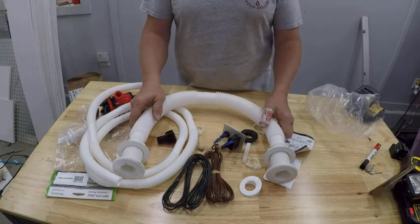These kits come with pretty much everything else you need: the wiring — it's already 10-gauge — clamps, and the three-quarter nipple you need to make your pump work. So if you're going to build a catfish live well on your boat, whether temporary or permanent, this kit's pretty much all you need. You can add oxygen if you want to, but for me I think that's just overkill — maybe in a hundred-degree temperature it might help some. If you're looking into buying a pump kit or building a live well you can take on and off the boat or even a permanent one, look into these kits. You can't buy all these parts individually for what you can buy the kit for, no matter how much shopping around you do.